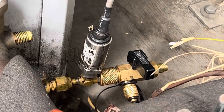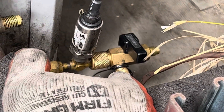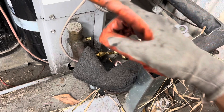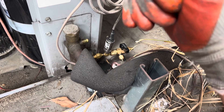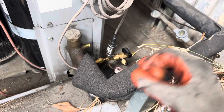Adding refrigerant took the temperature line down to 65 degrees going into the system, and it took the superheat from 40 down to about 32-35. I'm way too over-magnified so I'll wrap up here. I'll come back probably next Monday — too much work to do. See ya.